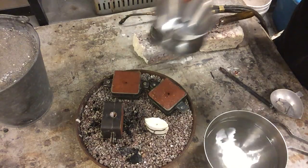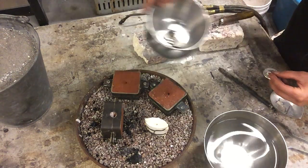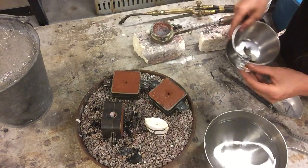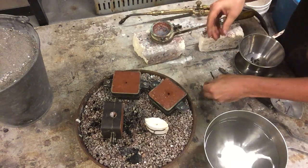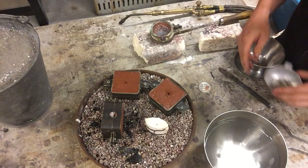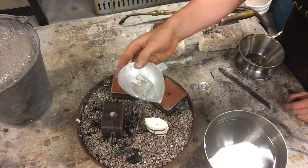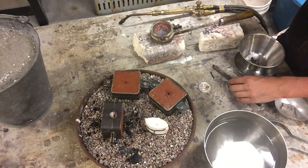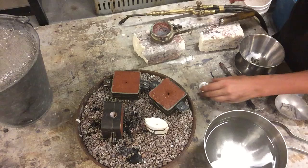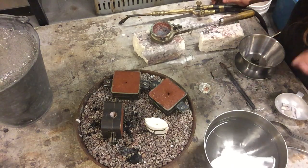You want your metal if you're going to be melting metal. We're doing this in a couple of ways — I've got some residual charge to melt down, a little bit where we discuss how to alloy, and then the tiny usable bits that come from jewelry work: the dust, the powder, the odds and ends. You want to have at least 10 to 20 percent new metal each time you cast.